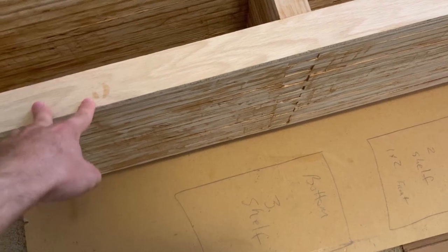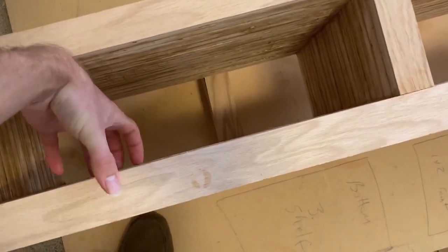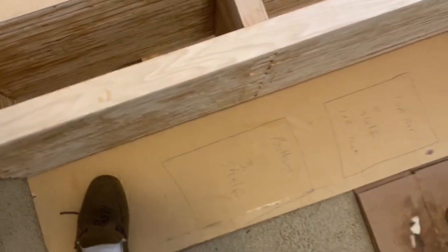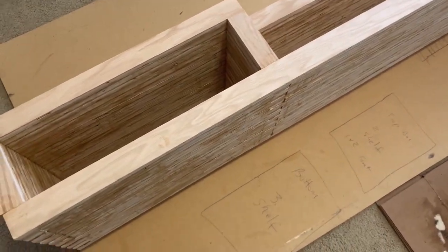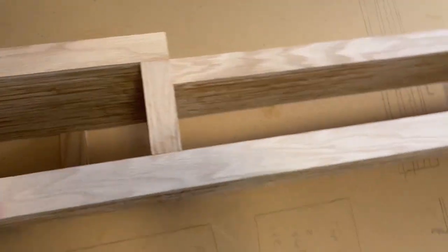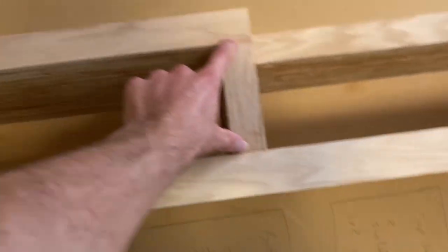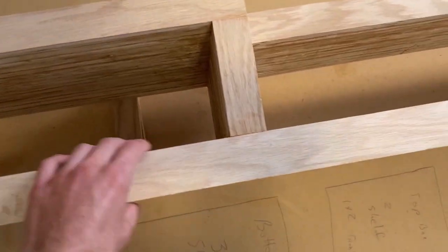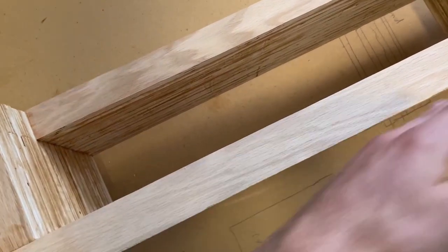And then I'm just going to start clamping them out, basically bringing the clamps in from the top like this so that they have room. And then, yeah, basically just bringing it out and ensuring that it's really nice and straight. And I'm going to just clamp from one end all the way down to the other end, because I won't actually have any reference points or any of that. So I'm going to have to also make sure it's straight this way and not all curvy from the imperfections in the table saw.